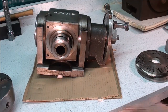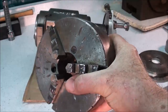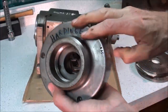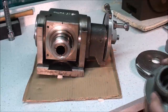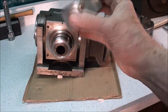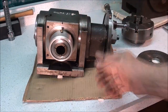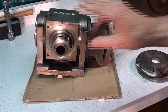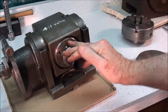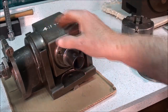The tailstock was probably thrown out. There was a chuck on it, but since this came from a vocational school, the chuck is damaged beyond redemption, plus it does not run true. This is also a hermaphrodite Hardinge thread, so that's a problem, and you'll notice there's already damage to the thread. So I went ahead and made a thread protector — there's no need to have that threaded, it just goes on with a brass screw that'll tighten down and hold in place. The beauty of the Hardinge is that it holds 5C collets, but the draw bar is long gone. So I made up a draw bar using the draw bar out of my spin index and adapted it, so it can still be taken out and used on the spin index.